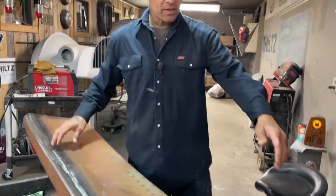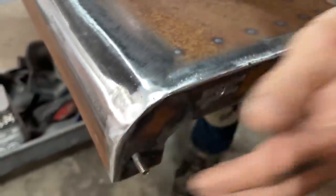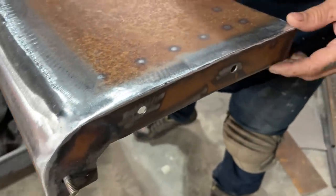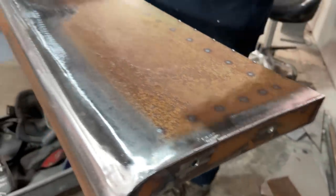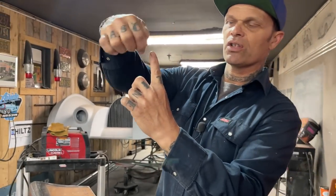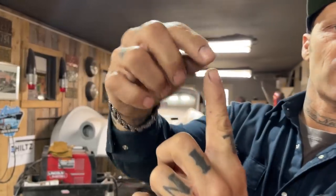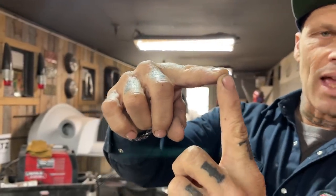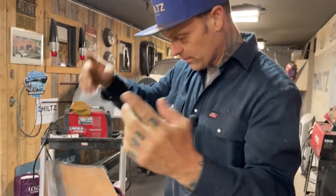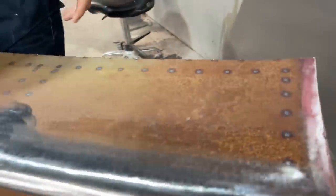You can see the ends, how this all got butt welded together because it fit the way I wanted it to. And I made sure that the metal was placed in the right place. If the metal was placed like this and I weld a big goober weld on the outside of her, I wasn't going to get it. But if the metal's like this, then I can weld it on the edge and buff it off. So that has to be reminded at all times. And as soon as you forget, then that builds that out longer, makes it not fit the way it should.